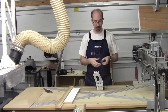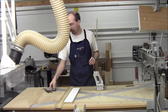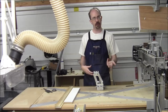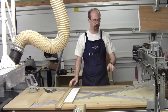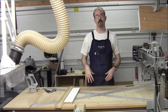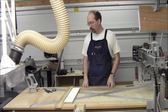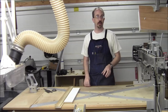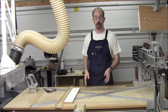We're going to set up and have it cut. We're going to take some poplar and do some test cuts with it today to get a sense of what I'm going to need to do for fixturing. Because it's all fine and good that you can cut these slots, but if you can't hold the board square to the axis of travel and it's not flat, a good chunk of your accuracy has a lot to do with how you hold your fretboard to the table.